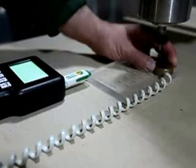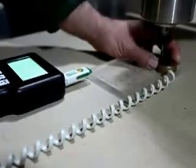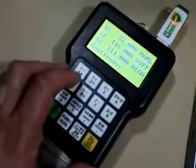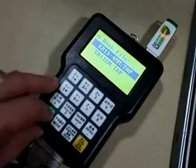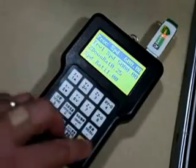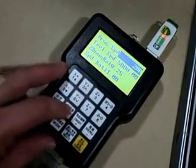So we'll just set that Z. Now we've grabbed the program for the 4mm cut, which I've called ER11 4mm dot tap, funnily enough. Now we're not going to run this one at 600mm, we'll run that at 2m per minute.